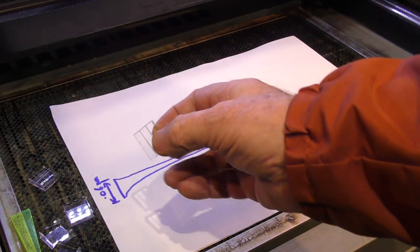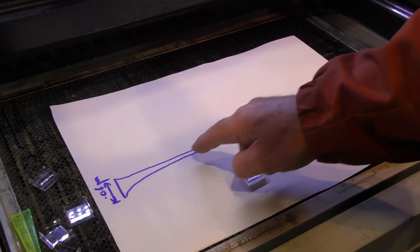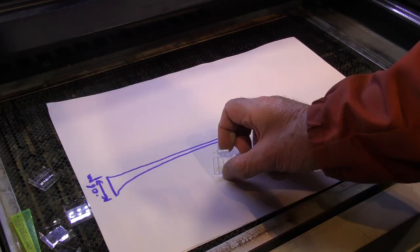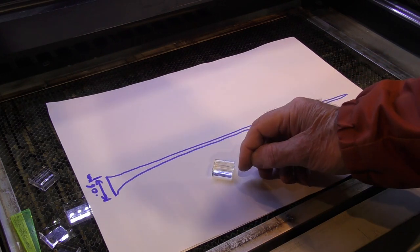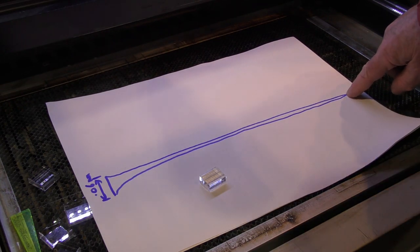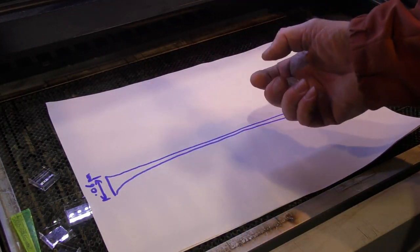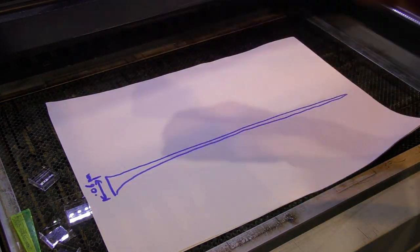And that is what caused that hole. By holding it on long enough, this very intense light spike was able to do its job. So bear in mind, it can only damage solid material that it comes across. So it's gradually boring its way through that material, little by little, because of its intensity. This is a difficult concept for people to understand. Yes, this looks like a spiky drill that's below the focal point, but it's not. It is intensity at the focal point, and intensity equals damage.